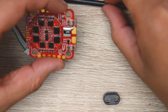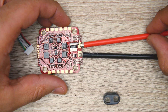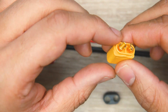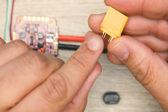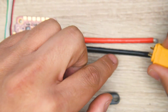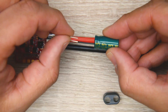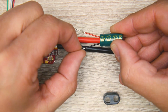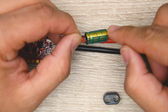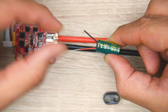To install the capacitor, take your black wire and find the minus terminal — installed right here — and positive goes right there. For the XT60, you need to know which side is positive or negative or you'll burn it. You'll see a little positive and minus sign on the connector: the plus goes to red, minus to black. They've added heat shrink to help identify the sides, but if you didn't have it, the gold stripe always indicates the minus or ground side.